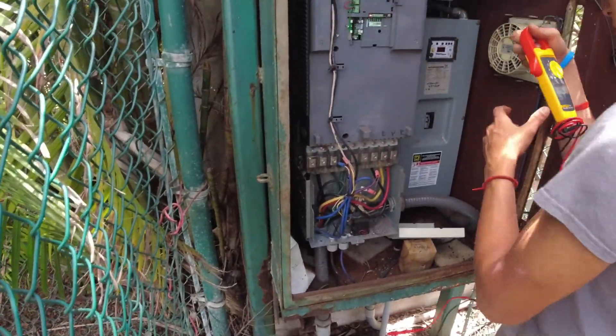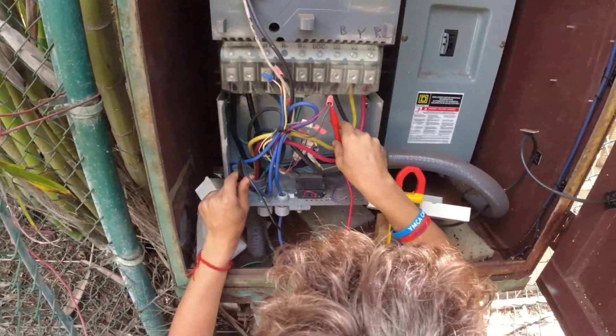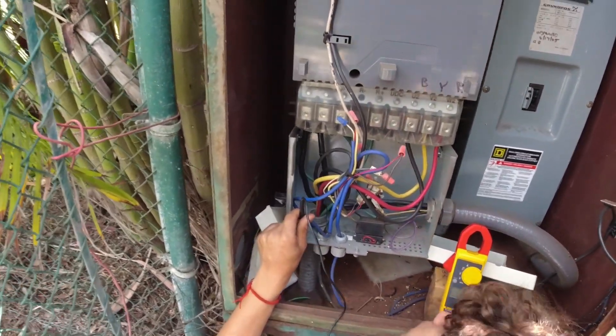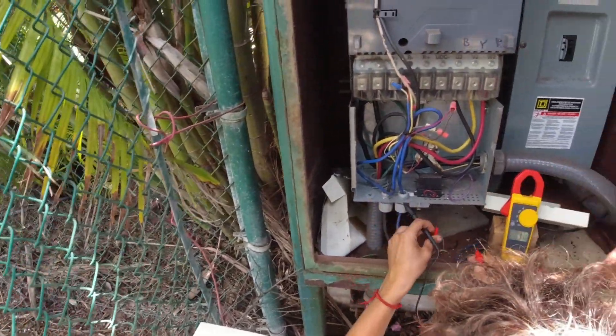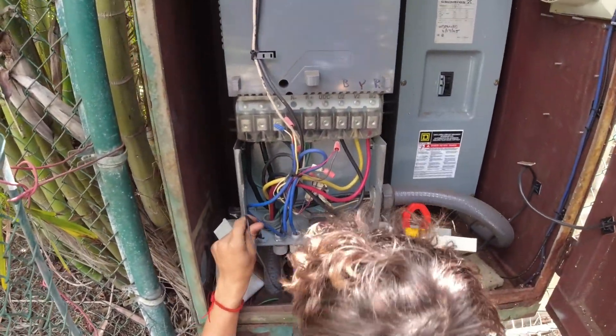You can go from lug to anything metal in there and that'll verify there's no voltage. Use something metal in here — some nice bare steel. You always want something that doesn't have paint on it. Take your little safety probe off just off the one and try to get your probe up in there.